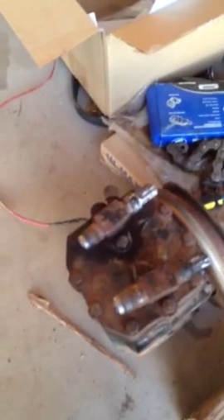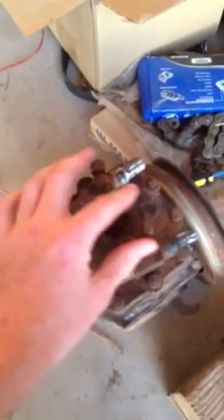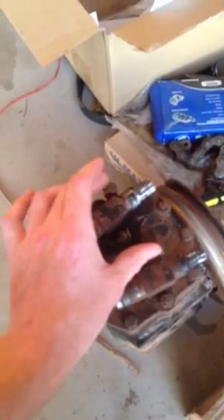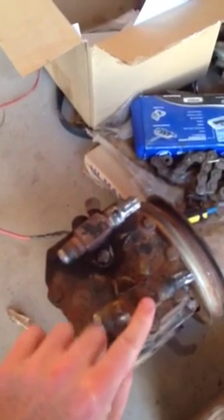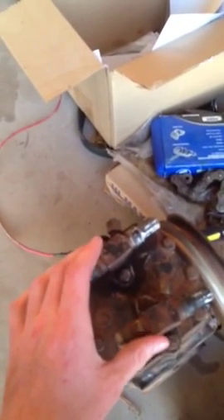Most compressors, if you're going to do an R12 to R134A switch, you've got to find the right valve fittings. I have pressure gauges that can fill either R12 or R134, so I'm good there. Most people have to take off these valves and switch them out to ones compatible with the R134 that you can buy at Napa or AutoZone.